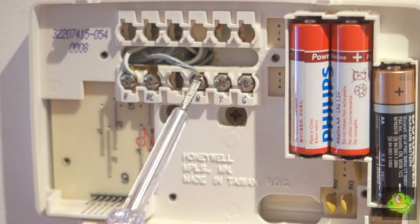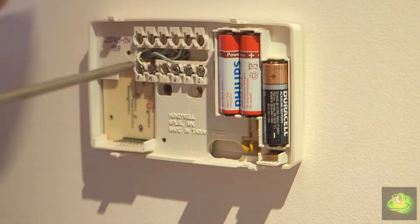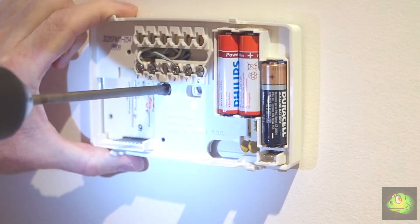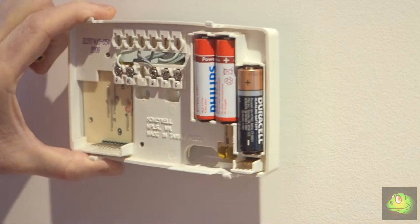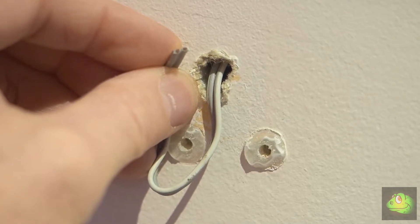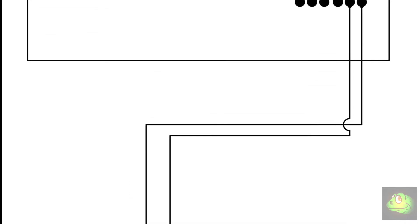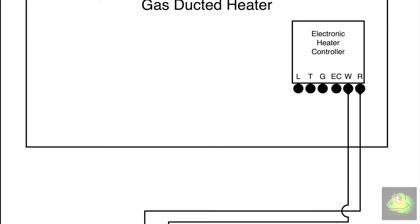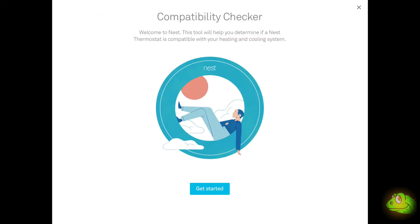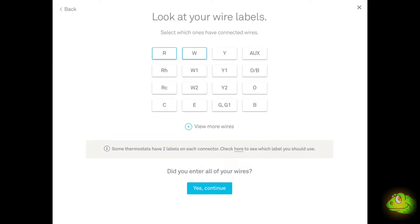When you go to the new thermostat, take out the two mounting screws. As we saw earlier, my thermostat had a single pair of wires connected to R and W terminals at both the thermostat and up at the heater end. When I went on to the Nest website and used their compatibility checker, I entered in the two wires — the R and the W — and the system came back and said that would be suitable for running the thermostat.